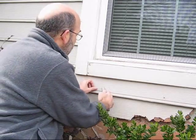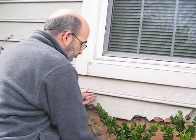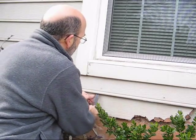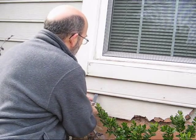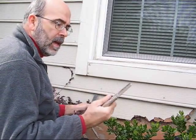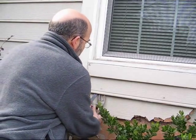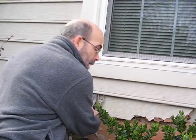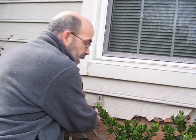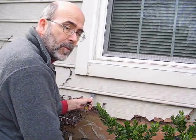Okay, what I do here is take a knife and I just peel away around the nail head, because that's what's holding me back right now. So I take like so, and I just keep prying at it. Now what I'm talking about here is I take these vice grips, and I go behind like so, grab a hold of that nail, and then I just start turning, twisting. And that frees that nail up for me.